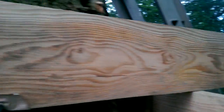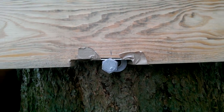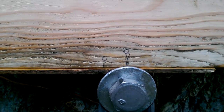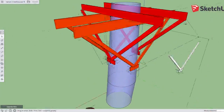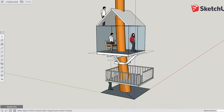The floor is going to be made of 2x8s — this is the first one. The ones closest to the tree get a bolt on them. We weren't able to put them totally perfect because it's a tree and you can't measure around a tree, so we had to cut a little notch. The center of the beam is not the same as where the bolt goes, because the bolts are hard to put in a tree since a tree is a weird shape. I'm going to fasten this to the bottom of the bolt.